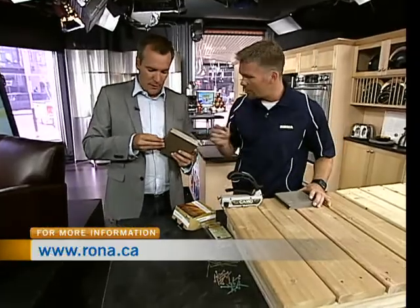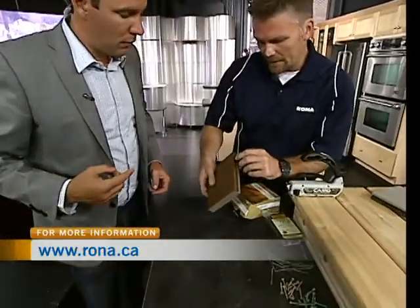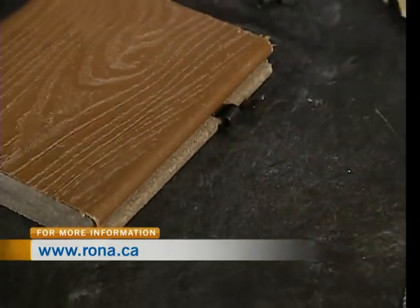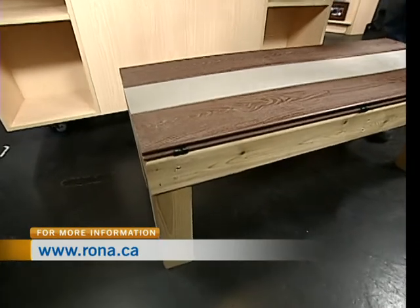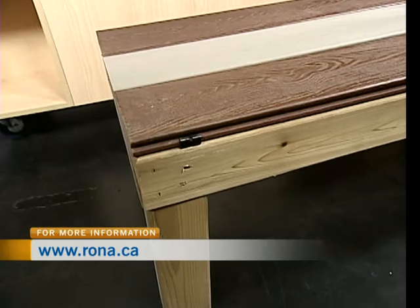It's got a really great wood look with no painting, no staining, no messing around. The Trex system fasteners fit in between the boards, butting up one against the next. You can see it on the little demo deck here — it works as a spacer as well. You're screwing them in, and when you look at the finished deck it just lays flat. You've got your one starter and then the others give proper spacing all the way along.